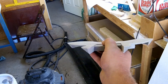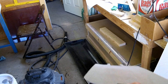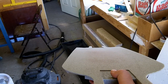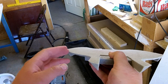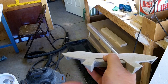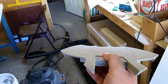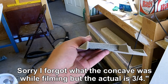Okay, I just got done thermoforming this a little bit. You can see that it goes back just a little bit to how it was originally. That mold down there was actually created on top of this other mold right there — I use it for thermal forming. Basically, what I'm trying to do here is just get this good enough so that when the vacuum pulls this down against the mold, it doesn't snap these thin edges. The concave right now is about three-eighths of an inch; on the finished board it'll be about five-eighths to three-quarters of an inch.